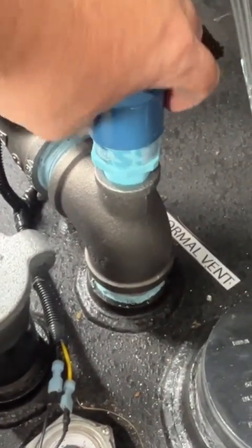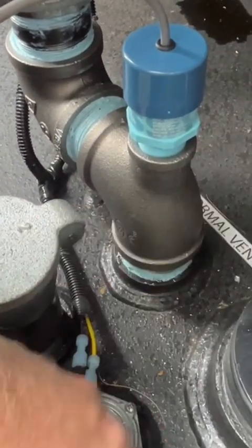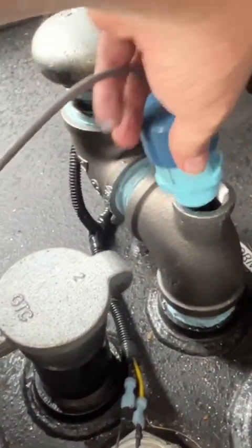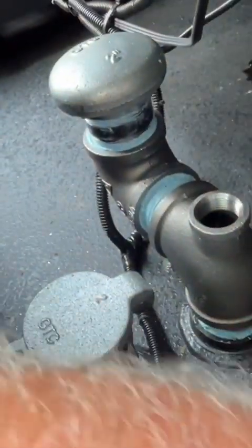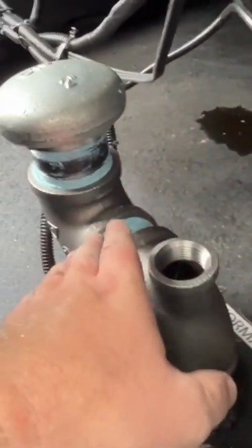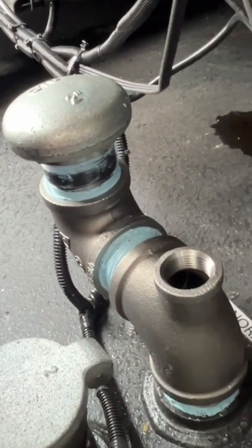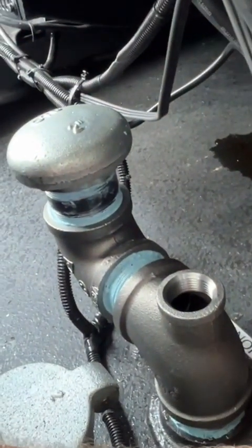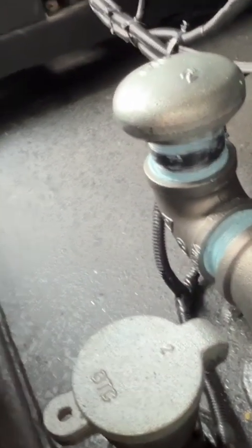So it's gonna be at least 4 inches from the highest point of the surface of the fuel, which it totally is, because obviously you're only gonna use 90% of this tank. And even if they overfilled it, I think we'd be pretty close. But not so much worrying about overfilling as we are rainwater getting in there. That's kind of the driver for all the sealing, so water doesn't get in here. It's inside an enclosure, but someone might leave the door open, or you just don't want water in your fuel. So that's why the sealing is important. But, so we're on to the measuring part.